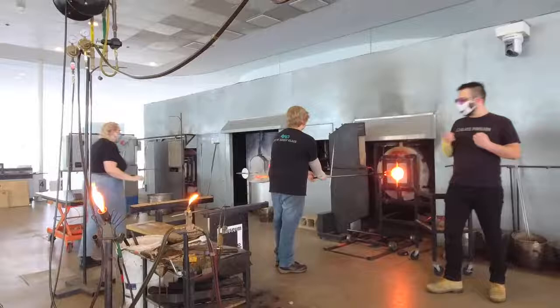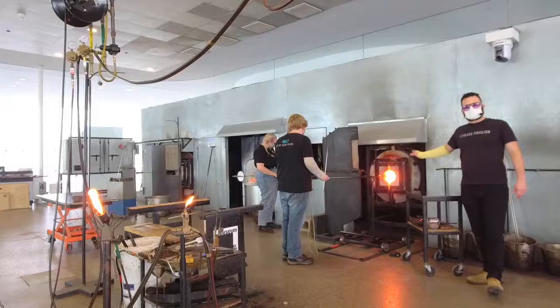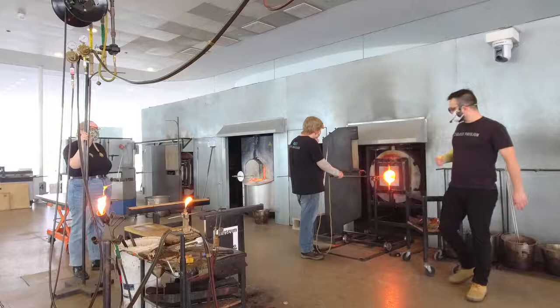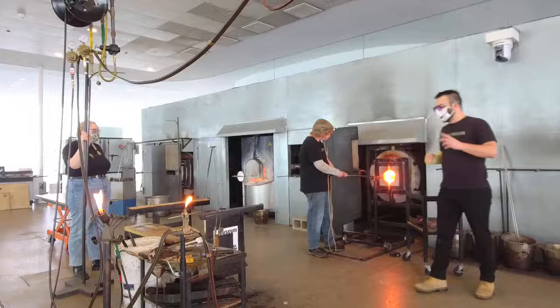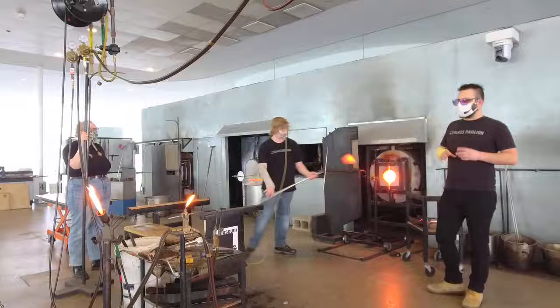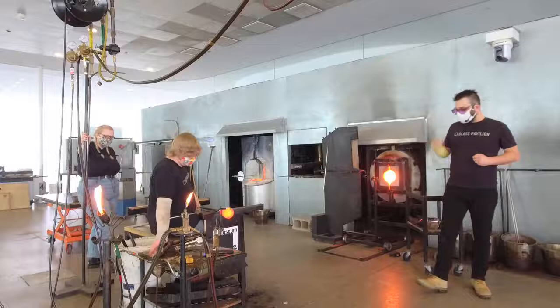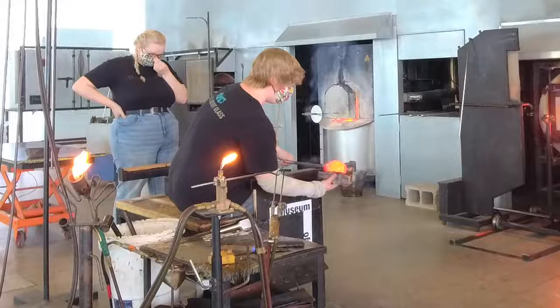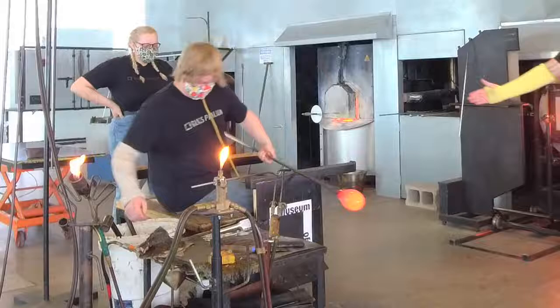His column has a bubble inside of this. He also has that very soft color which could easily come to the surface if he has it just too super melted. He's going back in, and then now we're going to start blowing out this hole. Now Colin's going to be at a little bit of a battle — because no matter how long you've been blowing glass, it's always still the battle between the blowpipe and the glass right next to it. Very hard to elongate that glass because it's the coldest — it's the last thing that goes into the reheating chamber and the first thing that comes out. It's also having the temperature pulled out of it from that blowpipe. So Colin's going to be using his paper to cool off the back end, using the stump and his fingers to cradle that glass and start inflating it. The air is going to go to wherever it's hot and expand out.